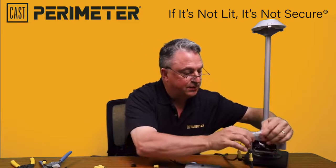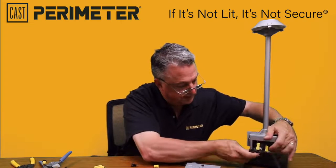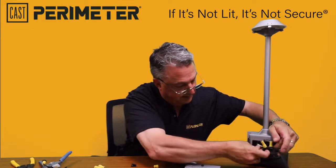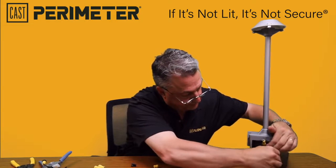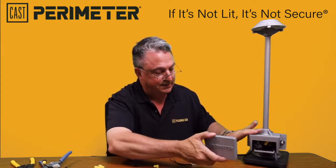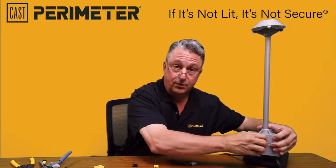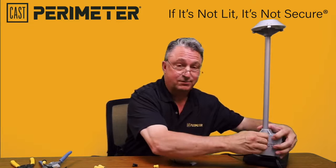On the fixture, simply put the quick connect together — that gets power to the fixture. Put it inside the junction box. You'll notice there's a slot on the base; run the splice inside the junction box, simply put the cover on the front, and you're off to the races — you've made a perfect splice connection.